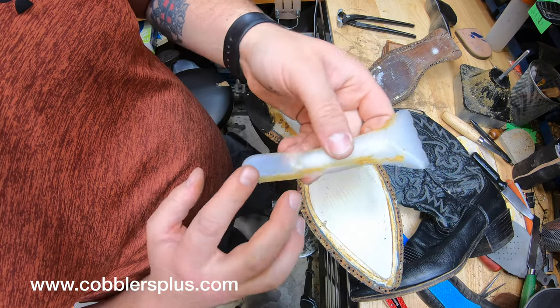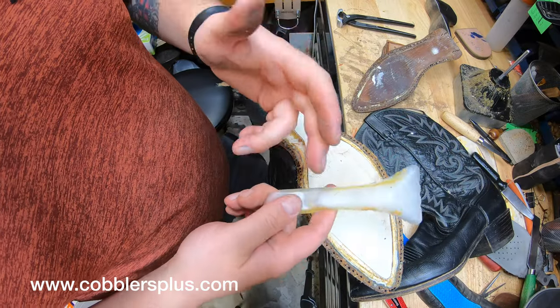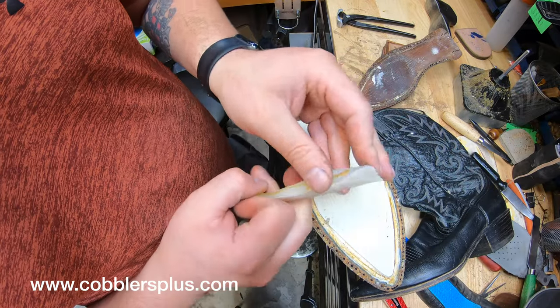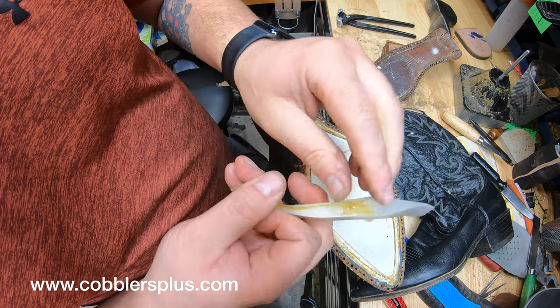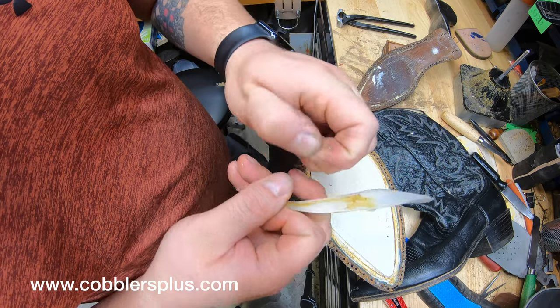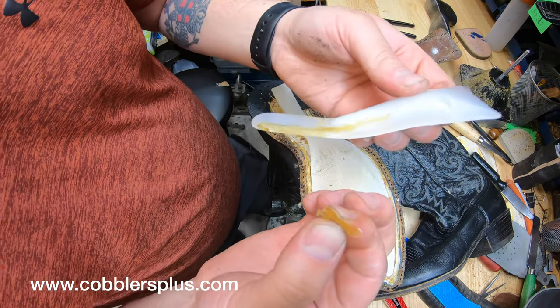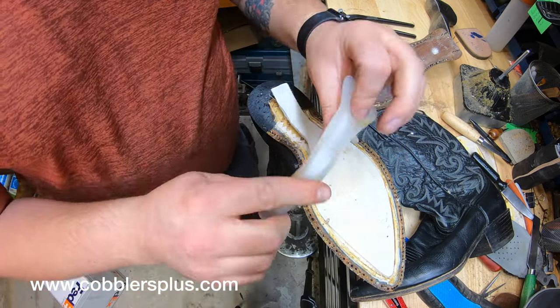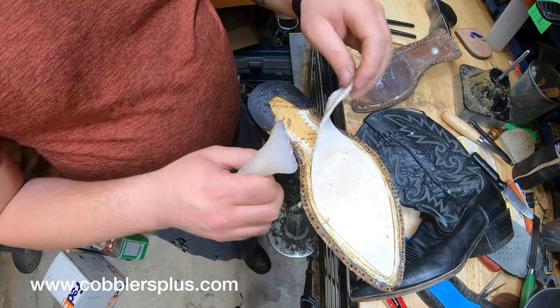And so what happens is when they've got that thick layer of glue that you can see right there, all that yellow, that glue just doesn't really bind well enough to such a smooth surface. See, it just peels right off very easily. Whereas if you have this surface area roughed out a little more, there we go, see, look at that. When you've got that surface area roughed out significantly more, then the adhesives bond to it better as well.